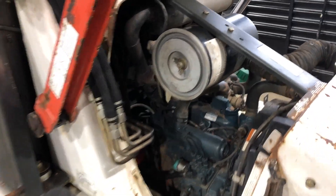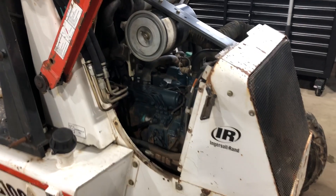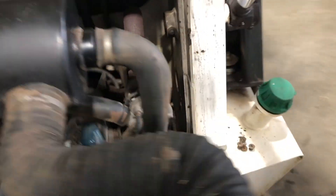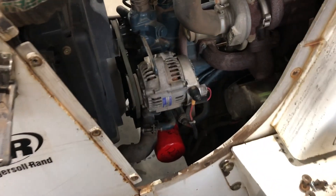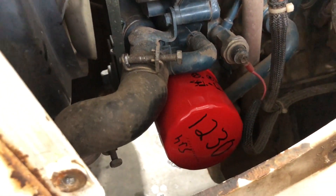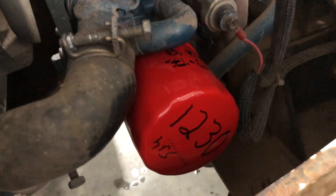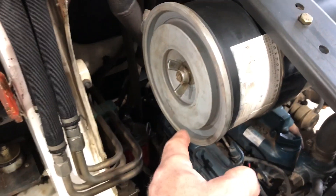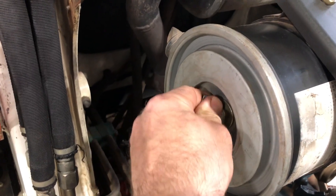Got all the filters changed. The way this works is the side panels come off — there are about five bolts on either side. Take all those off and you can easily get to both sides of the engine. The oil filter is basically just spin it off, spin it on — drain the oil. I always like to put the hours on there when I changed it. The fuel filter is a spin-on fuel filter as well. You spin it off, spin it on. The air filter is in here — you take this wing nut off and the air filter comes right out.